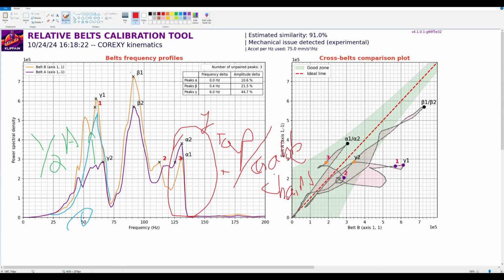Loose screw in the tool head, loose screw on the X carriage attaching to the X linear rail. I'm looking for something on your input shapers to show this. I'm going to be looking at around this same frequency in your input shapers. Does it show up?